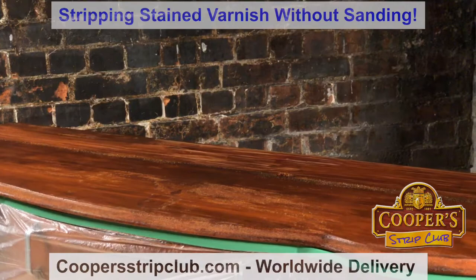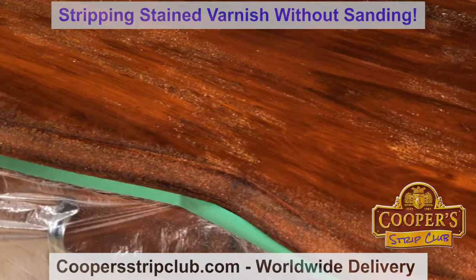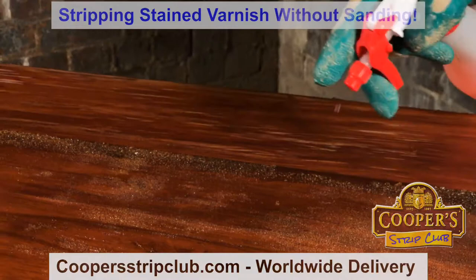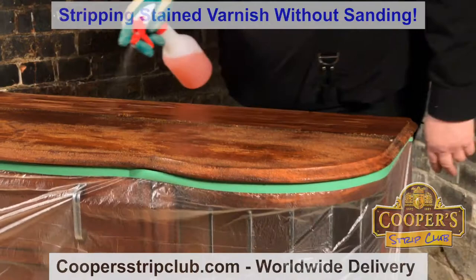It's going to need about five minutes of soak time and we're going to keep it wet with the stripper as it goes. On this side over here you can see this drier patch starting — that's not that I've missed it, it's just that the stripper has been fully drunk up. So we just spray more over the top, which is a real advantage over hitting it with a brush.